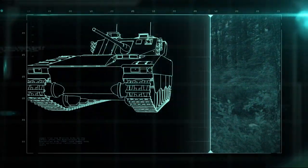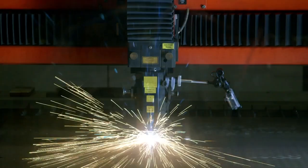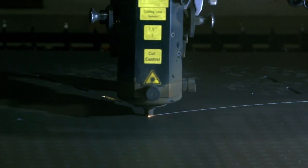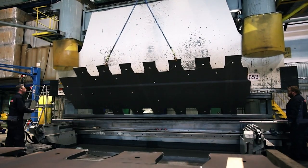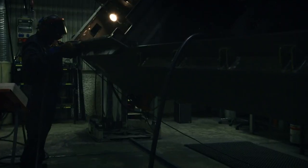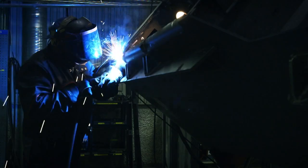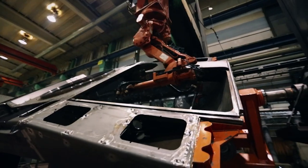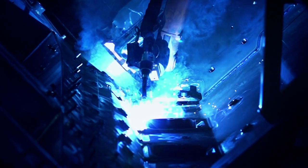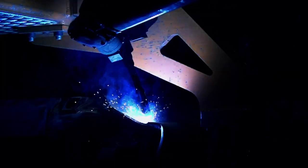The CV-90 armadillo breaks down into the turret and the tank body. The CV-90's armor plating starts out as laser-cut sheets of bulletproof metal. The automated beam carves out holes for sights, cables, and weapons stations. Then the precision-cut sheets are bent into shape under 1,800 tons of pressure. All the pieces are then assembled — first temporarily welded together, then hoisted onto a robotic welder that automatically performs thousands of accurate welds. The same job would take a team of human welders weeks, but after a full day on the automated welder, the job is complete.